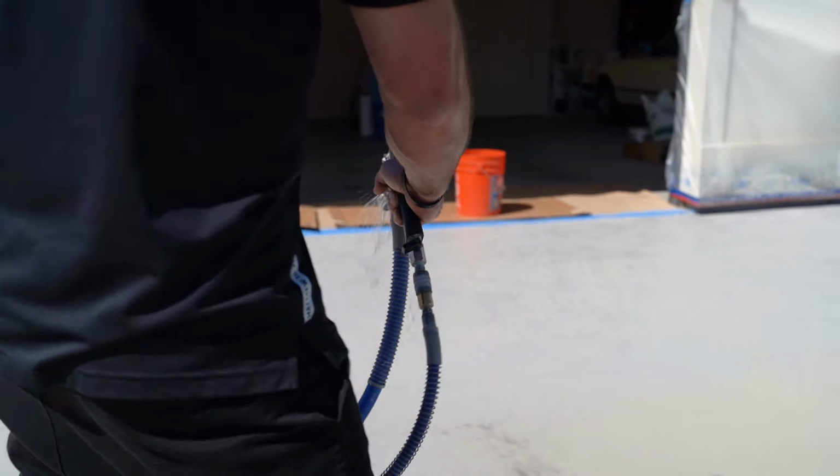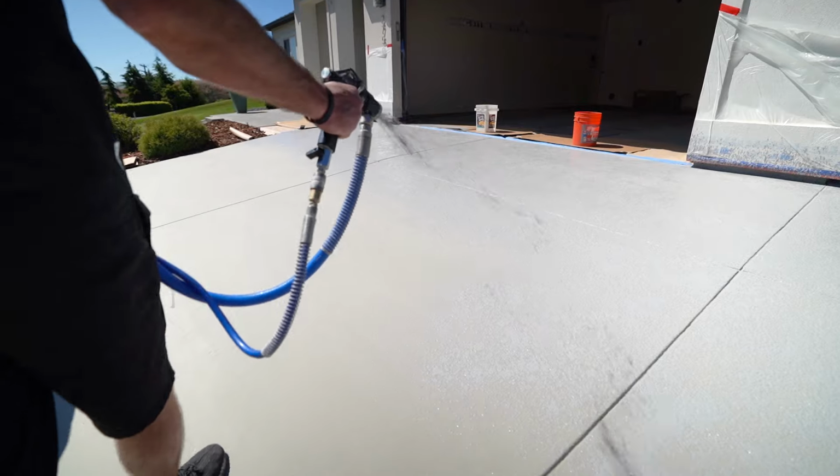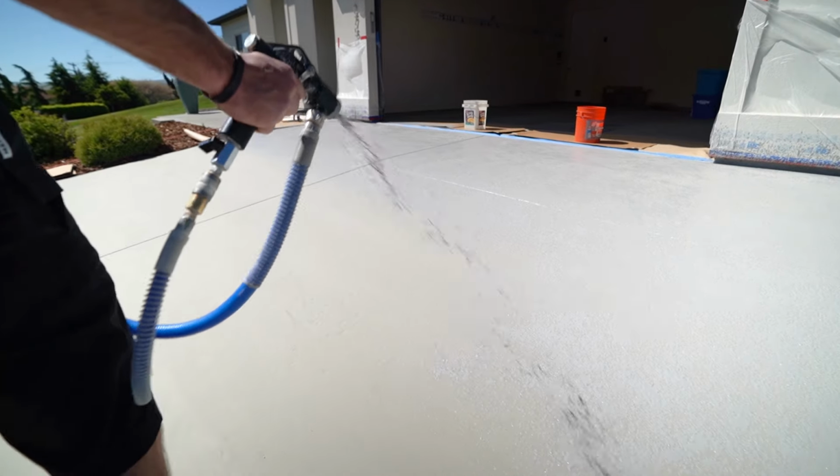Instead of doing our concrete repair system, which is basically a squeegee finish or a broom finish, and if you guys are ever brooming overlays, they are a little bit more time consuming. They make more of a mess. They're more of a hassle. So we like to either leave it a squeegee finish or do our texture deck system over it. That's what Brian sold them on: doing our texture deck system on this driveway once it's prepped and filled and everything addressed where the concrete's failing.